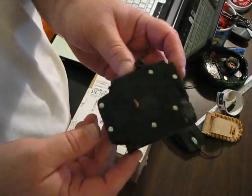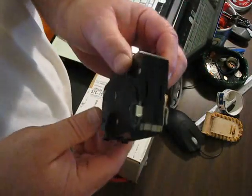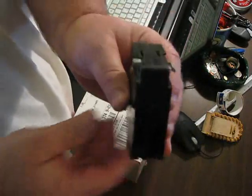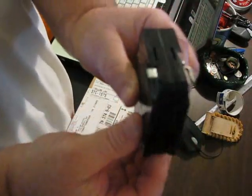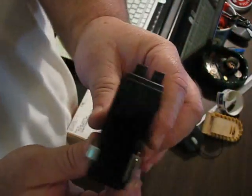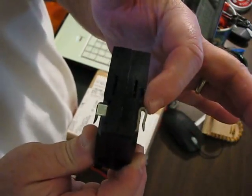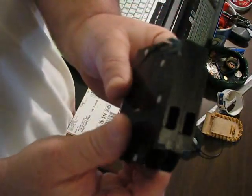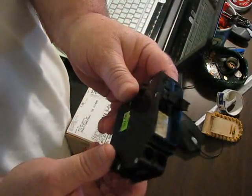What I have here is an old Murray breaker — it's an MH220, meaning it's a two-pole 20 amp breaker. These things are obsolete, so if you have these in your panel box you might want to start collecting them, because they're going to be expensive soon, or you may end up having to replace your whole breaker box. You can tell they have these two little bunny ears that pop out. This one was defective — it's got burn marks and was getting ready to start a fire.